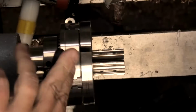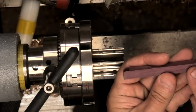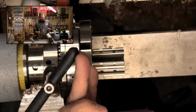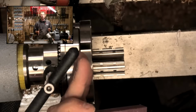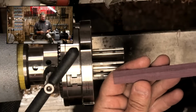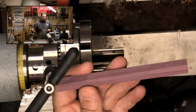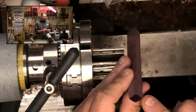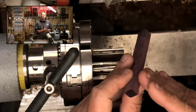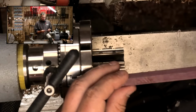This is an old piece of Purple Heart. So this was a corner of... So I get the timbers in for fruit making generally in 1 or 2 foot lengths, so 12/24s. And then instead of just cutting from square, I'll cut the corners off by putting the bandsaw on a 45, just whipping those lengths of corners away. And then those triangles, I take those corners off of those to become a little square section. So we've got a little square section like this.